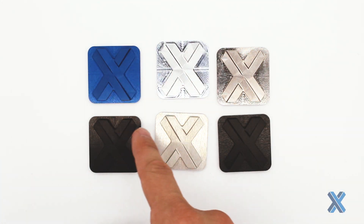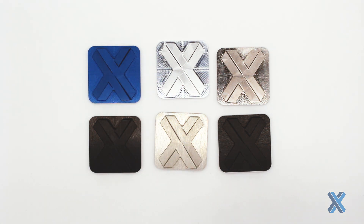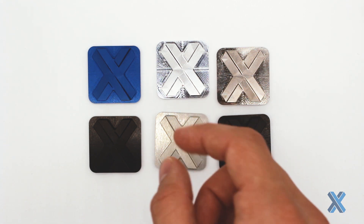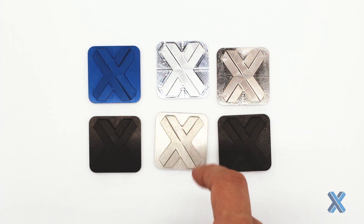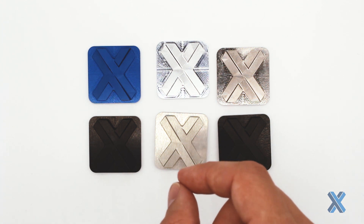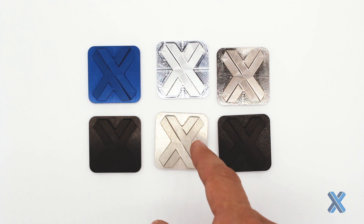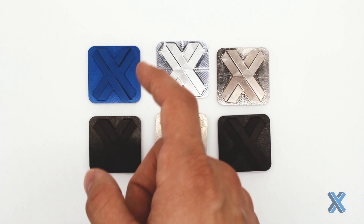I have over here a few examples of anodized parts. Anodizing is a dip bath that controls the oxidation on the outside of the part and can even implement pigmentation. A type 2 clear anodize, like this part in the middle, gives it a matte, clouded surface finish compared to the natural finish, but it provides an insulated outer surface as well as high levels of corrosion resistance. Type 2 anodize is also great for adding pigments like blues, reds, golds, and purples.